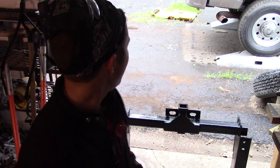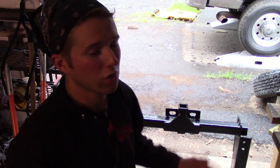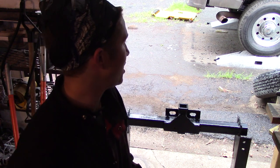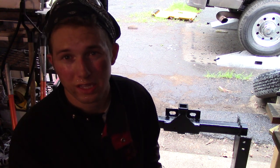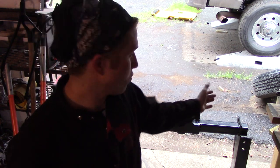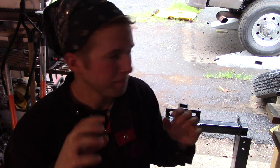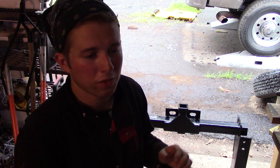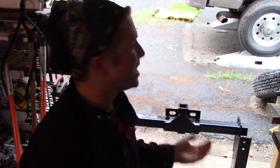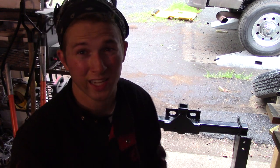And in addition to that, as you can see, it's raining outside now, but before the rain came in, I actually got underneath the truck and took a paintbrush and some Rust-Oleum, knocked off any loose rust I could find, and then I pretty much coated the frame. In the rear half of the frame, from the rear axle back to where the hitch is going to be installed, I was able to get on the insides of the C-channel frame, but from the rear axle forward, I was just able to get the outside, and I got anything else that was rusty. I mean, we're in the Northeast here, you know. Rust is eventually going to win. We're just trying to delay it as much as possible.